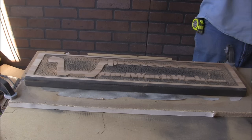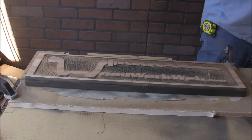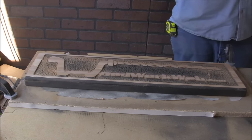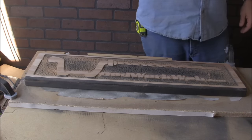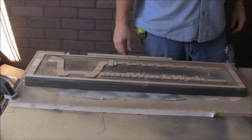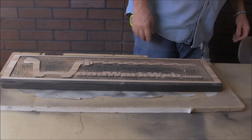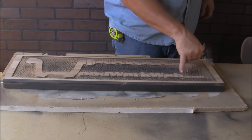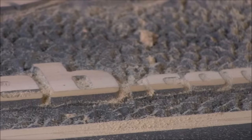I do, however, have an abrasive planer, and on rare occasions I use it. All it is is a rotary sanding drum, and I do on occasion use that. But a planer with knives, I won't use, just because it has a tendency to chip out the letters, and that ruins the sign. You have to start over. You can imagine what it would be like if that little period on the .com chipped off on you as you were running it through a planer.